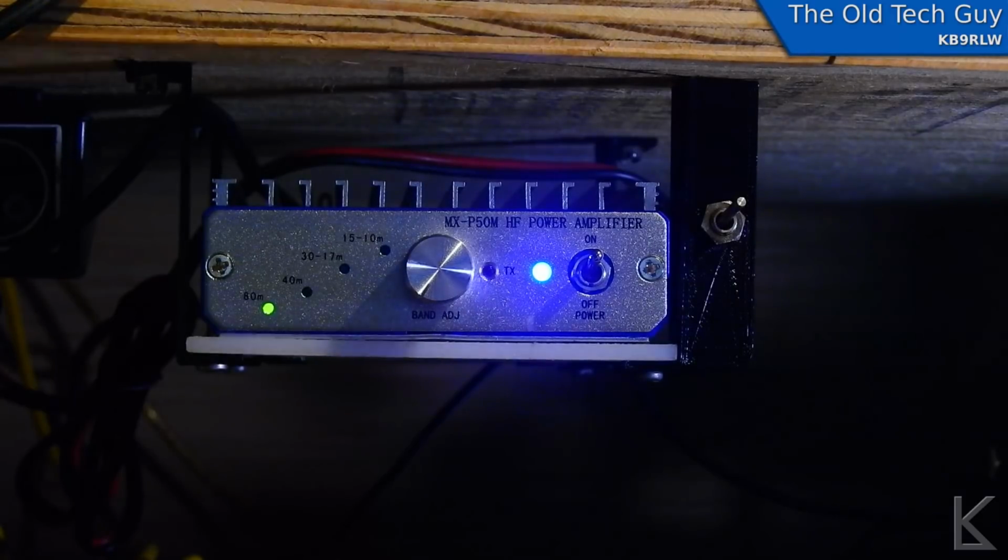I've got the RS918 set to 5 watts. It's actually driving about 2. And I was getting about 30 out. So, it works! Little transistor keying circuit fixed it. And it's an improvement, I think. So, the modification worked. The amplifier now keys properly for both radios and seems to work pretty well.